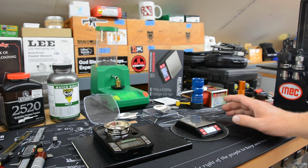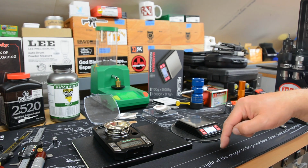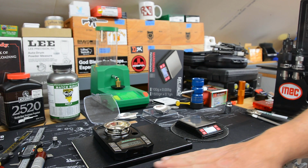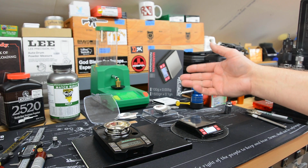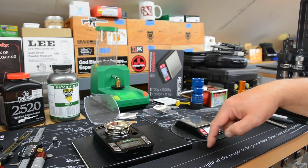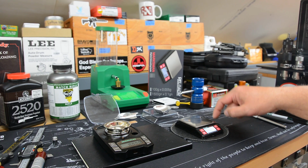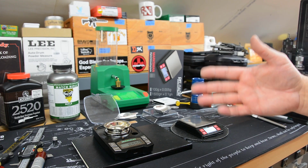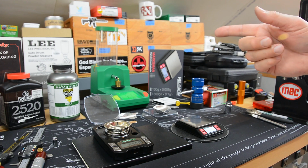Now, one other thing to note here in all this, I'll go ahead and do the pan studies on each one of these, have some weight on the platen and see how they repeat. But one thing to note is, to try to knock out vibration, I have two mats. There's a felt type bench mat here, then this neoprene rubber type mat, and then the Chargemaster Lite has a rigid body to it and adjustable feet, so it's leveled and sitting on one in the rear. But the ones in the front seem to be affected a little bit by the sponginess of the rubber when you put weight down, like it was tilting and compressing the rubber. So I put them underneath hard bases, and it seems to have stabilized them till they repeat a bit better. So try and take out variables like vibration, and like I said, I shut off all the airflow up here to try to minimize air currents. So we'll finish this and then we'll take a look at the data.